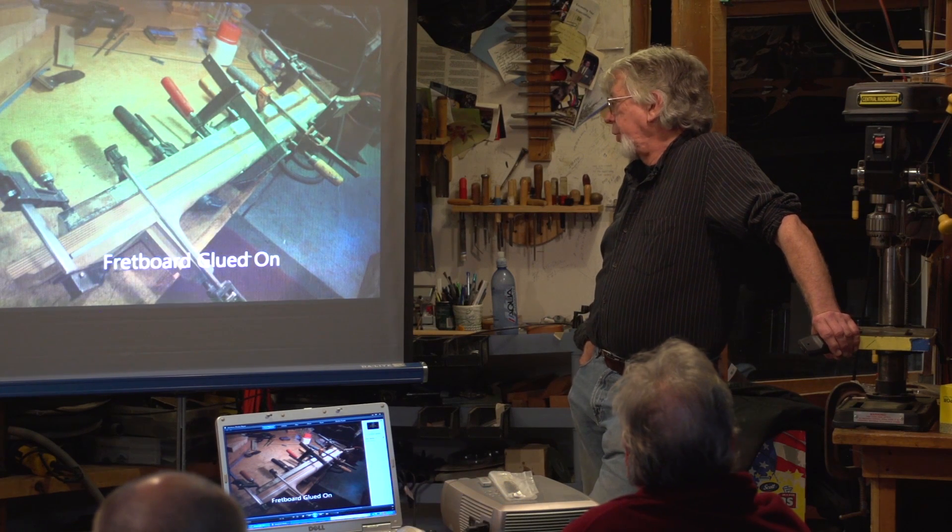This is an ordeal to fit a neck on a guitar in a traditional way and then glue it on. In this case, I bolted the neck on and I'm going to glue it because it's got a big tenon. Now I'm going to glue it because at first this thing was so radical. What I told Jack is: I'll make this so that no matter what happens, we'll be able to make it work. Fitting this is done with a compass and a scribe, just like you fit a cabinet. I figure a six-hour budget for getting a neck on a guitar.